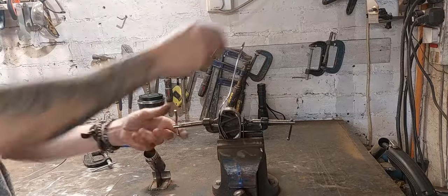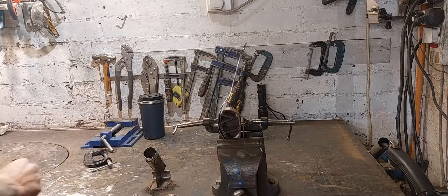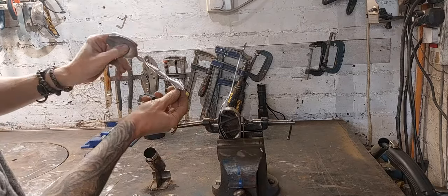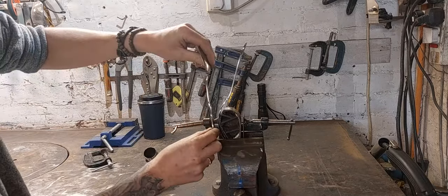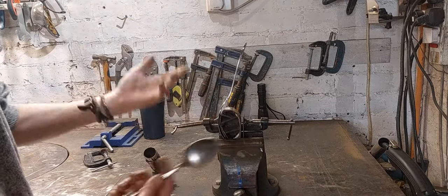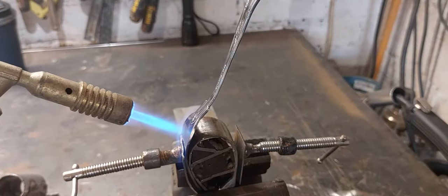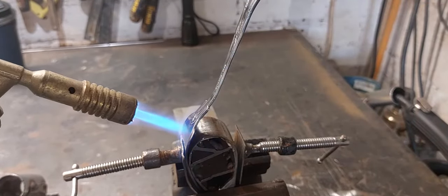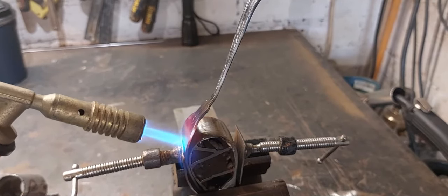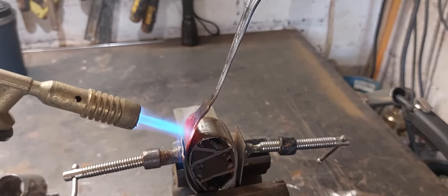and then what I will do is heat this up with a blowtorch, create the curve, open it up. I will then put the patterned handle, the Anida decorative spoon handle, on the outside. Shape that to the exact same curve. Do that twice and I've got each side of the bird. Starting to get quite hot, and that really nice glowing orange colour, get the metal nice and soft.